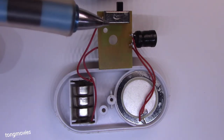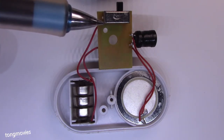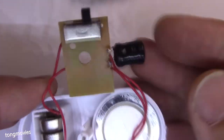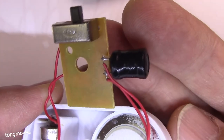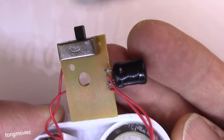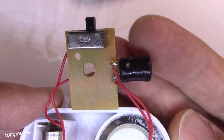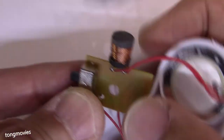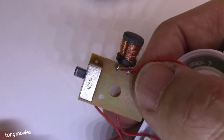The power switch. It kind of looks like a capacitor, but I'll open it up to show that it's actually an inductor to the Piezo speaker. Unfortunately, I've damaged the inductor when I cut open the cover. You can barely hear the alarm anymore.